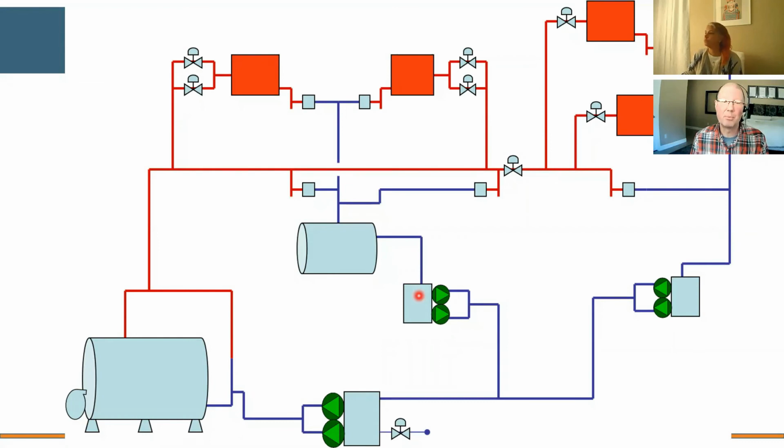Yeah, really good point. If you think about old boilers in homes, a lot of those were just gravity systems, and they worked on vapor pressure, well less than a pound of pressure, and the steam would simply rise up. It would head over into a radiator. It would get trapped. The condensate would naturally return back to the boiler. There were no pumps. It was some math, but it worked.